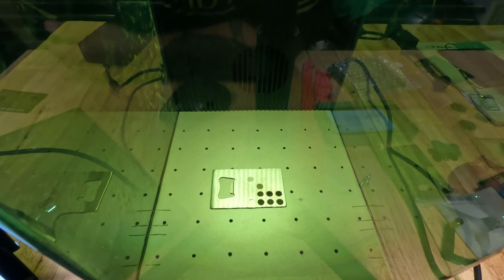When it goes to the edges it has a lot more power for whatever reason — I see the sparkle jumping higher when it gets to the edge. Every time it goes to the edge it gets a higher sparkle right on the edges. That might be causing the halo because those sparks are stronger. The black though is really pretty — it's coming really nice on the stainless steel. Something like this on the F1 small version would take you forever — doing it at 1 mm/s and probably 25 passes to get this dark, and you might never make it.